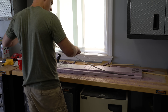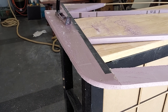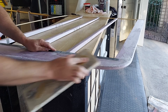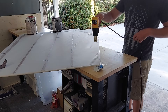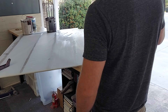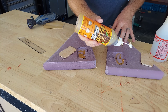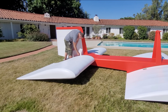We still needed to make the rudder for the glider. This would be constructed out of foam, carbon, fiberglass, and a wooden trailing edge from some trim I found at the local home improvement store. To finish up the glider structure, a rudder mounting fixture was fabricated that would allow me to capture the rudder with a single bolt. The rudder is a little flimsy so I may end up adding wires to stabilize it — we'll see how it goes.